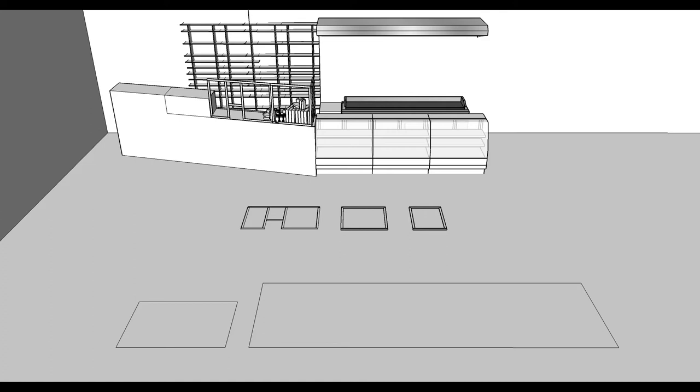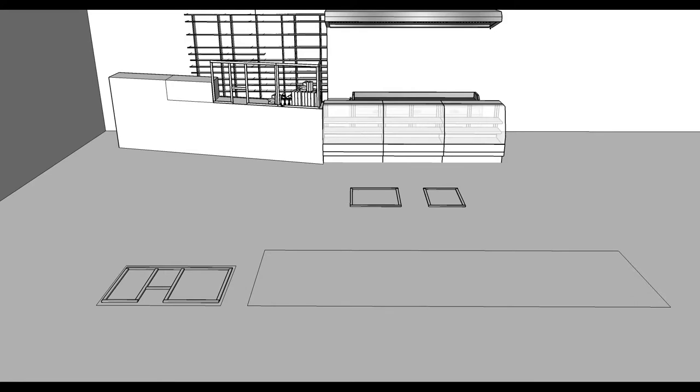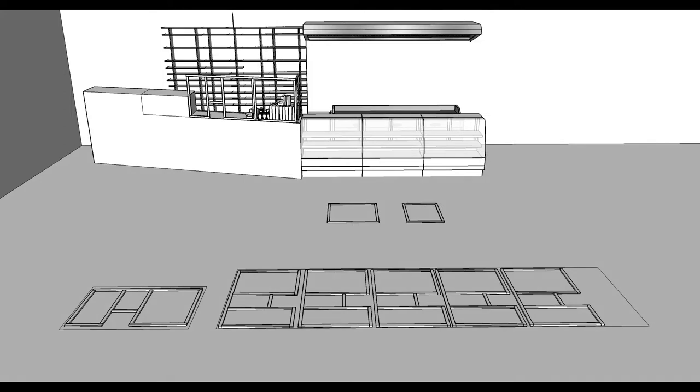I've done over 20 stores at this point, and I should have started with the larger packet, the 62 by 210 inch packet. I'm going to explain that to you right now. So this is my standard 59 inch panel with the door. Now look, I can make a bunch out of that larger piece there because the max width that I made at 59 was for that 62 inch dimension. And that is the width of the 210 inch sheet. Right, so you get a bunch in there.